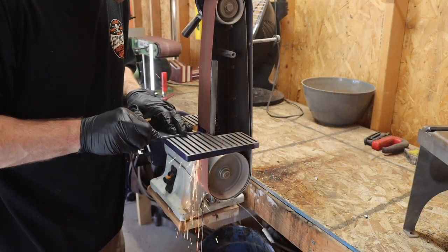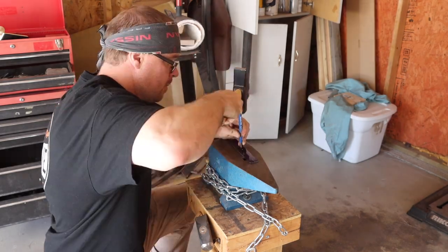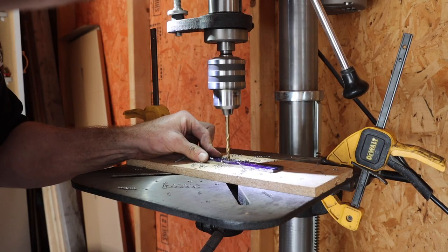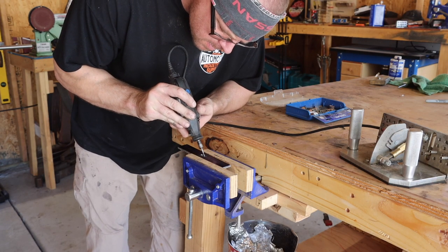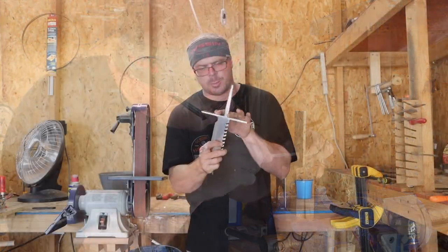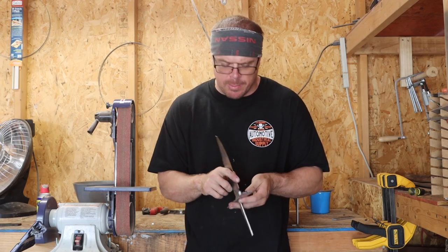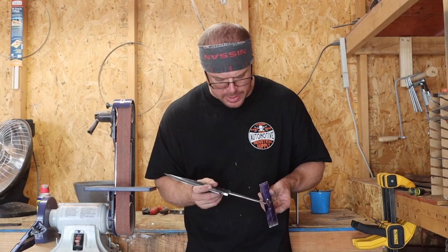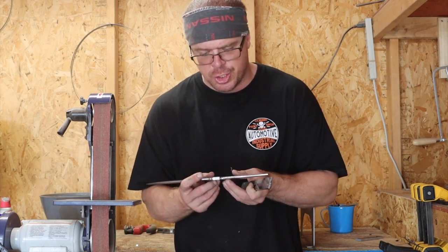I started by just making my piece of 1084 square. I scribed some lines, then went over to my anvil and center punched some holes to keep me on course on the drill press. I used a combination of my Dremel tool and a whole lot of file work to get this guard fit. It's just a little bit loose though, so I'm going to take it over to my anvil and peen or push some of this metal to close the gap up a little bit, then hammer it on for a pretty tight fit.